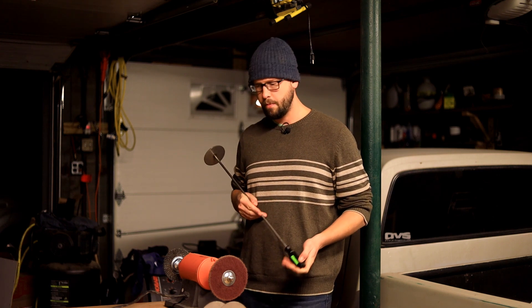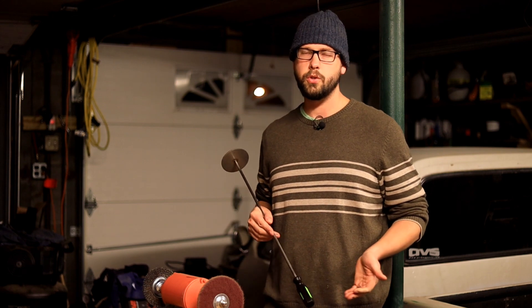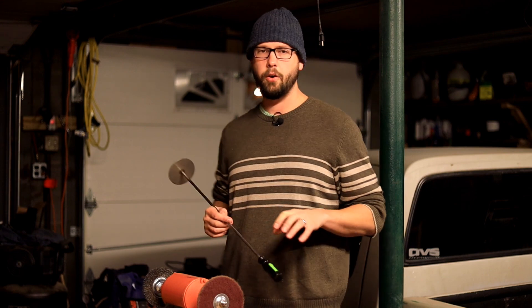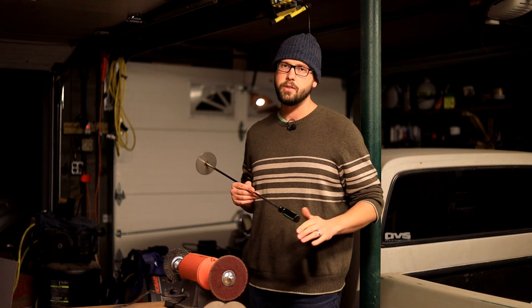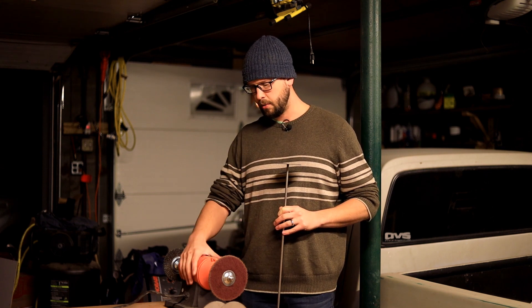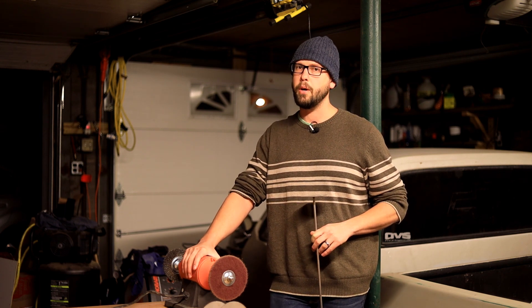Hopefully this works out for you. I recognize that sometimes this tool might not be usable in your application, but this technique is pretty much universal. Like, if this was a flat piece I would use an orbital sander with some really high grit paper — 400 plus — and just sand it off, which would actually be even easier. I just can't use that because of the contours of my piece. You can pick up these benchtop buffers really cheap; this one's from Harbor Freight and you can get them on Amazon — I'll put a link in the description. If you like these how-to videos and want to see more, be sure to click the subscribe button below. Thanks for watching.